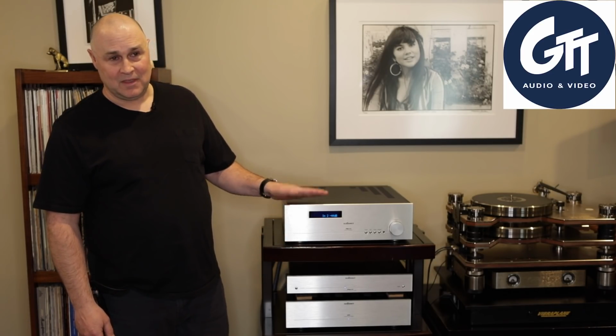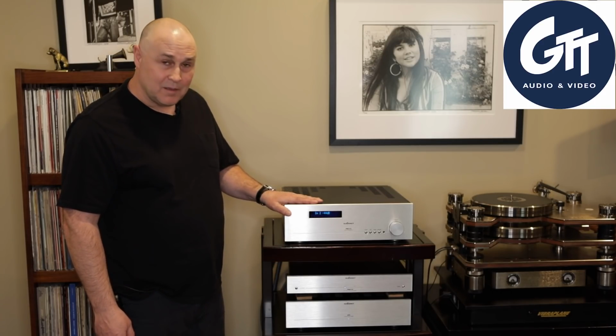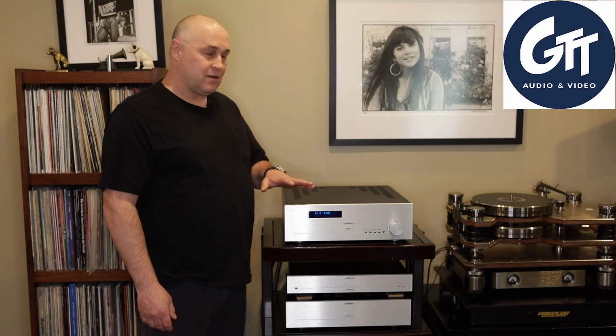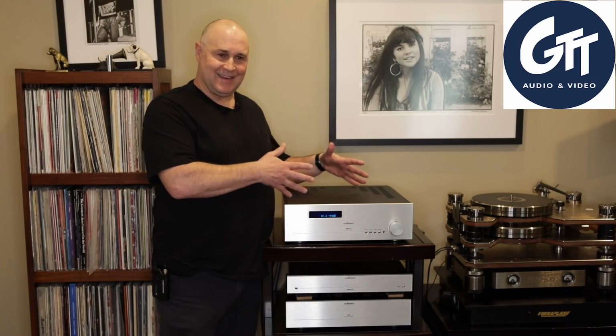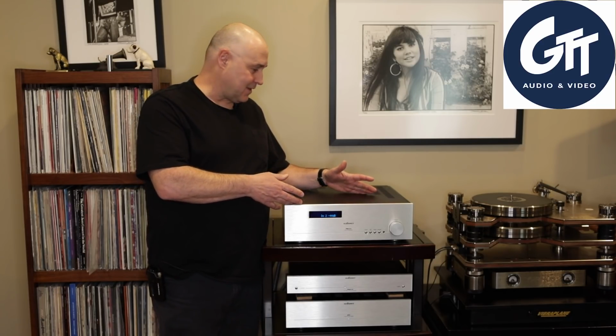Now they upped the game. They took the impedance in here in the circuit, again real, not corrected, 22 ohms this time. And bandwidth, they doubled the bandwidth out to 2 meg, or 2 million hertz. No option for external power supplies. What they knew, they incorporated into this unit. So it's already got an EPX or more built into it. It doesn't need one. There's no option for that.